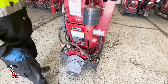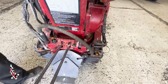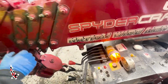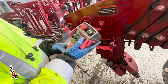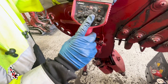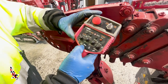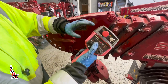When you want to go into crane mode, just pull up this little tab — the stand will drop and the crane will come up. Flick that switch up, this light comes on, and the crane will say remote mode. Turn on the remote, check it's connected, and the horn should sound. Everything's labeled: this is for rotation, this extends and retracts the telescope, this is winch up and down, and this is boom up and down. Whatever you want to do — boom up, winch down — just pull the trigger. Pull the trigger to extend, pull the trigger to retract.